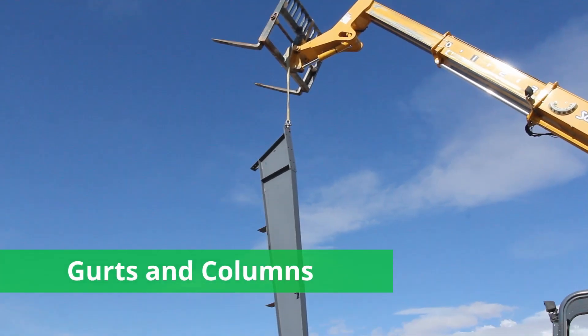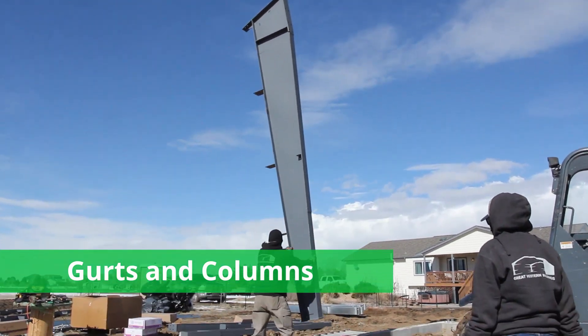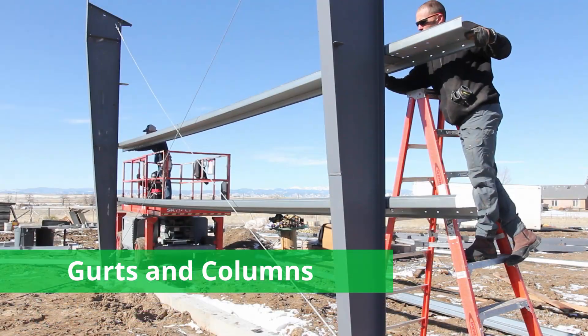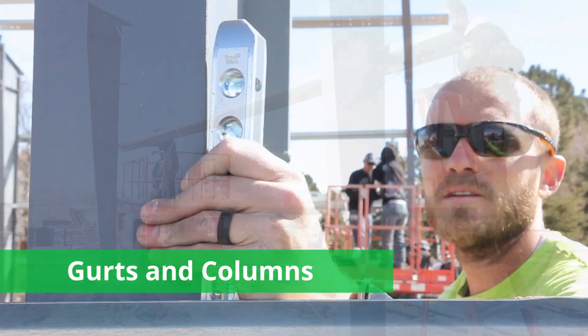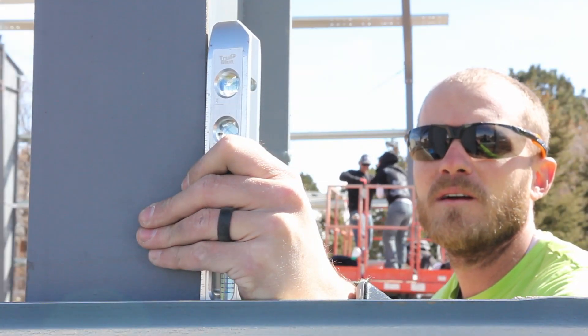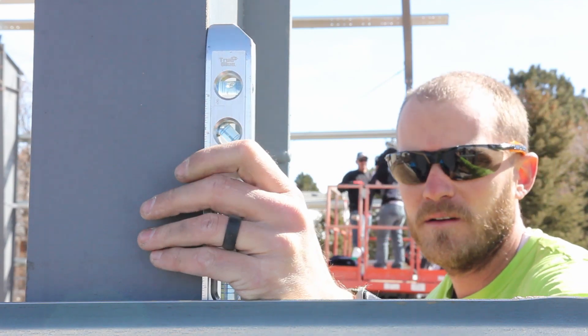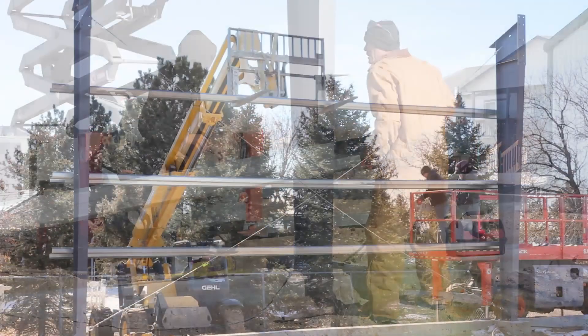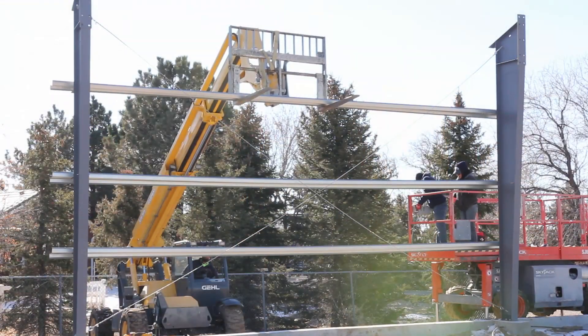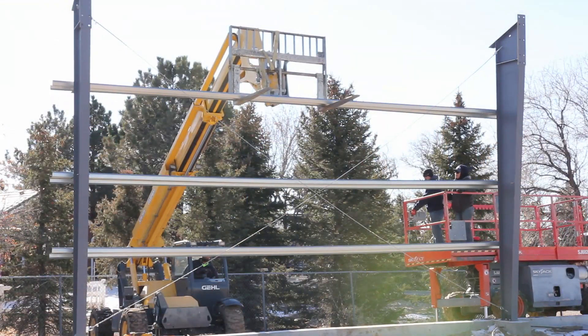The first place to start is pretty obvious. You're going to want to start on the sidewall columns, preferably in a brace bay if you have that. Once you get a couple of columns set, add a few girts, and then you can go ahead and start to square and plumb those things before you tighten any bolts down. Once you've got all of your wall columns and the girts on the sidewalls, then you can go ahead and move over to the end wall columns. Don't start hanging rafters yet — let's get all of our girts on. I like to do the end walls last just because the frames or the other columns and girts will give them a little bit of extra support.